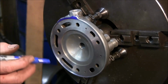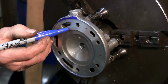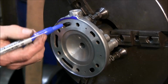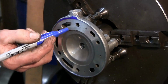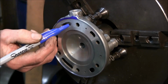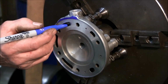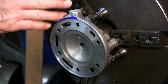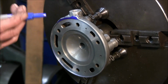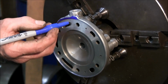Okay, I'm extremely happy. We have about two little tiny dots down in here, right next to where the weld was. I'm not even sure it's undercut, but regardless, nice blend, nice and smooth in there. I was happy I went in here and gave it a little rotary burr. Down in the very bottom you can see the full penetration from the outside of the cap or the top of this thing. Nice and smooth and round. I like it. This here I held back a little bit. It just makes it a little bit stronger.